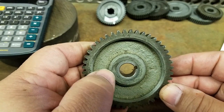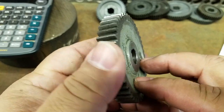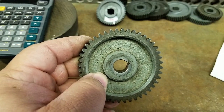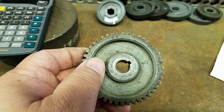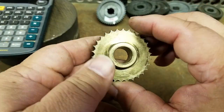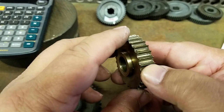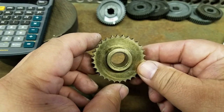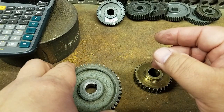With the information obtained from measuring the worn gear, I now have enough confidence to order something online. Hopefully I can find something that matches very closely and maybe requires a small amount of machining to get it onto the lathe. We'll start with that, get the first gear done, and if that goes well, we'll get the second one done — because I believe the one right next to where this one is mounted is worn as well, just not as dramatically. I believe that one's a 28-tooth gear. We'll get that off and measure it too.